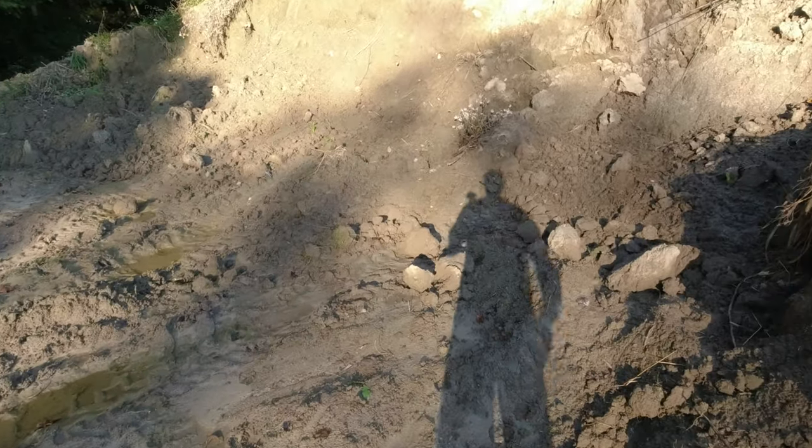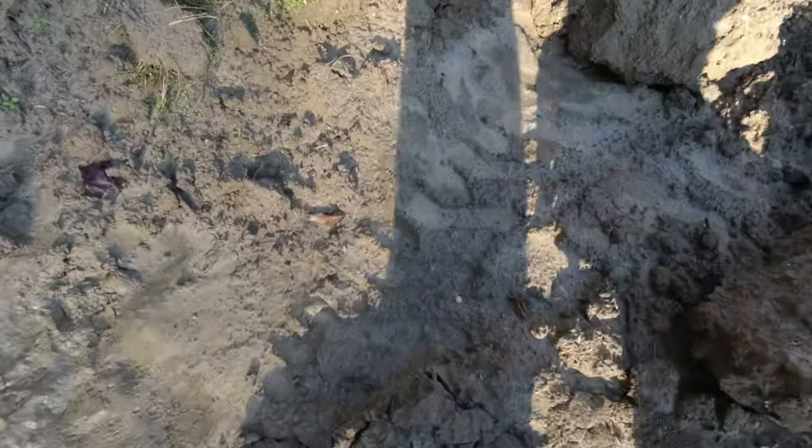So imagine placing stone on top of this and the amount of force that it would take to push through this hard pack clay. It's a great road base. Topsoil on the other hand does not provide much structure and even when it does dry out, it still remains very soft and spongy. Very easy to see how rocks could press through this. I highlight that difference because I am a big proponent of not using geotextile fabric. If you can get down to virgin ground that has nothing but clay, you don't need geotextile fabric. If you're building a road on loamy soil or topsoil and that's all you have to work with, then I would advise putting down geotextile fabric. The point of geotextile fabric is to prevent your stone from pressing further down into the earth and essentially losing it, thus having to add more and more over time. Out here we have nothing but clay and we've always just built our roads straight on the clay without using geotextile fabric.